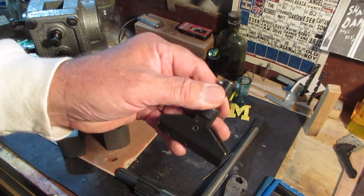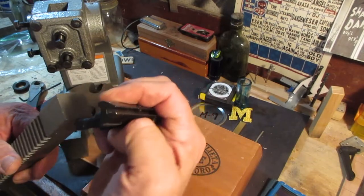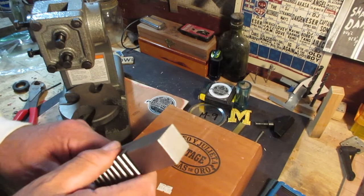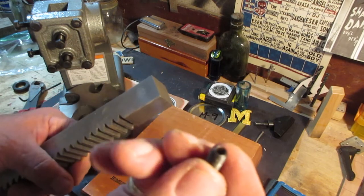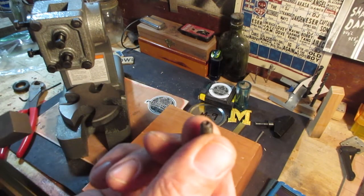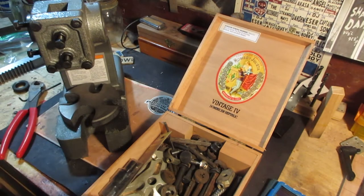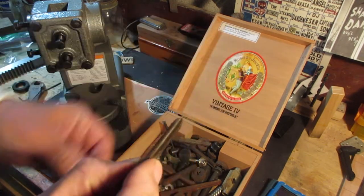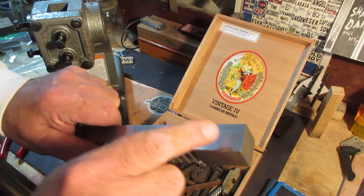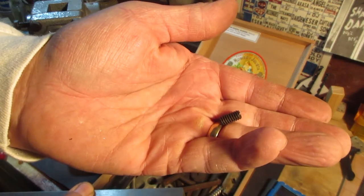Now, before I forget, once this hole is in here, it accepts this, where you can turn it any way, so you're going to have to have something to keep it in there. And so you're going to drill a hole right here to accept this set screw right here. How are you going to do that? Well, you find the same size bit as this, and then you get into your Do Not Covet My Tap and Die set, because you've got a bunch of them in here, and whichever one matches the threads on this, looks like that one, you're going to thread that in the hole right here so you can screw the Allen plug down and hold this gadget